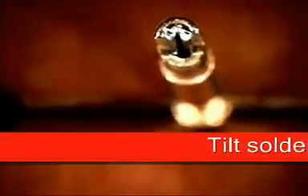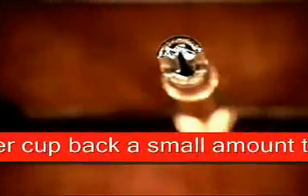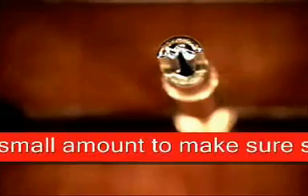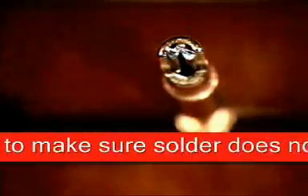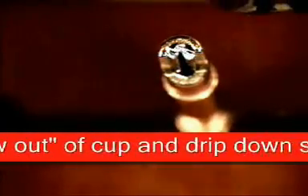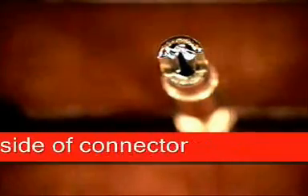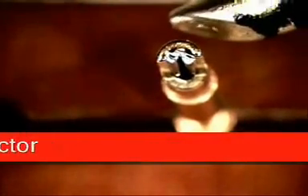I try to get right here in the center with a minimal amount of solder. Angle the tip back a little bit so if the solder does get a little heavy, it doesn't drop out of the front. You just want to angle just back a little bit. Next, add a little bit of solder to the end of your tip — just that little amount — because what you're doing is creating a heat bridge, which will reduce your dwell time.